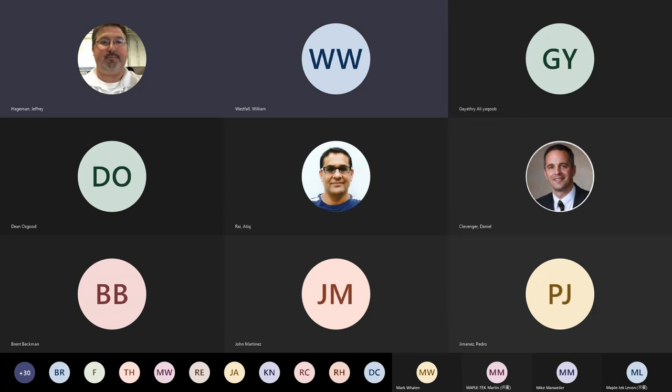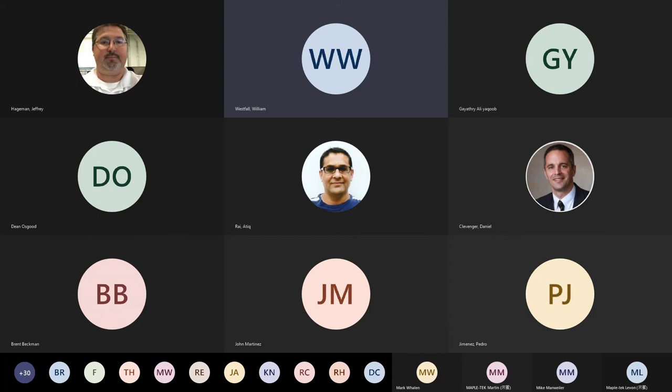Yeah, and I can go a little bit further with it too. The biggest difference between the slip printer and roll printer is the number of characters that they can print on each line. If you have the roll printer hooked up and you have your printer type set to the old font A for a slip printer, what's going to happen is you're going to wrap the text below to the next line. The reason is the slip printer has the capability of printing 35 characters per line, whereas the roll printer can only do 33 characters per line. So if you have it set to a slip printer and you're using a roll printer, it's going to take the last two characters and wrap them below. So if you ever put a roll printer on and you're getting some weird looking ticket where everything's all spaced out, chances are that's why, because it's set to the slip printer for 35 characters, but it only has the ability to print 33, so it wraps the text around.